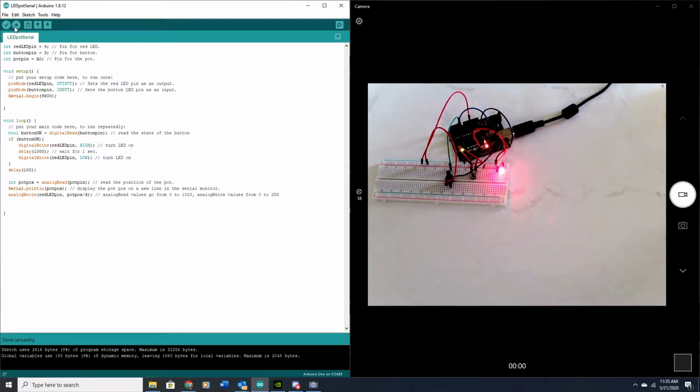The last thing I want to talk about, and since this video has not been too long yet, I'm just going to incorporate this into this one, is changing the behavior of how this works based off of the code to get some desired output. Say what I really want to do in this example is press the button, and then based off the position of the potentiometer when I press the button, I want it to have a certain brightness, and then I want that brightness to decay until it gets down to 0, and then I want it to reset.